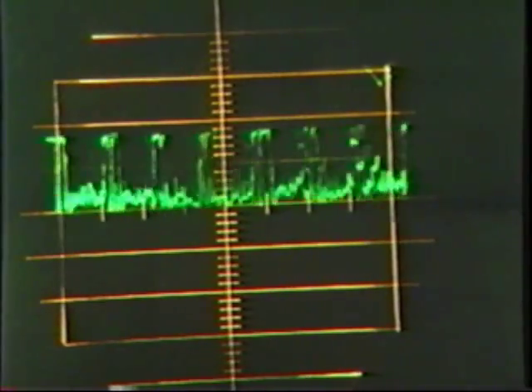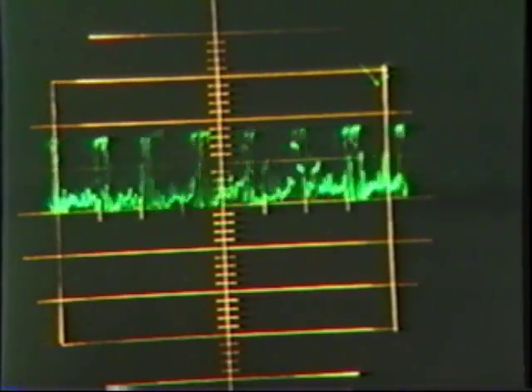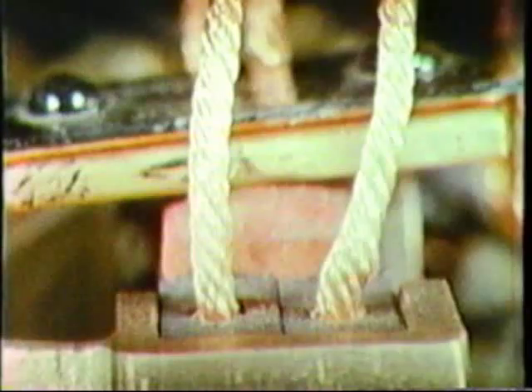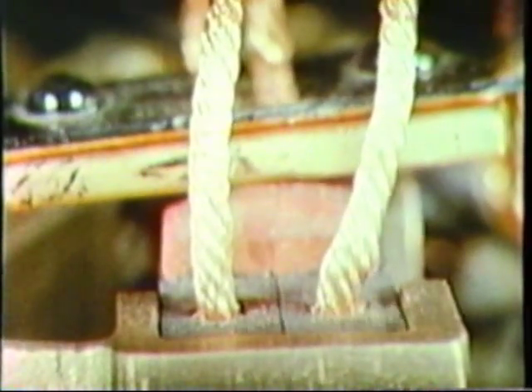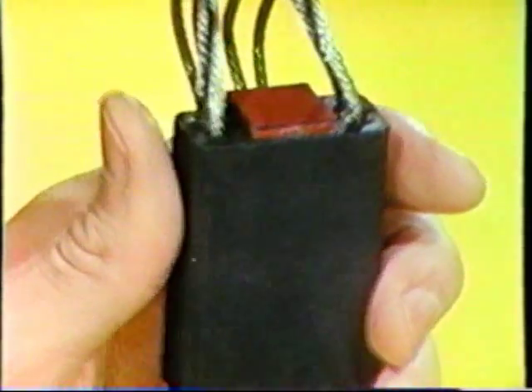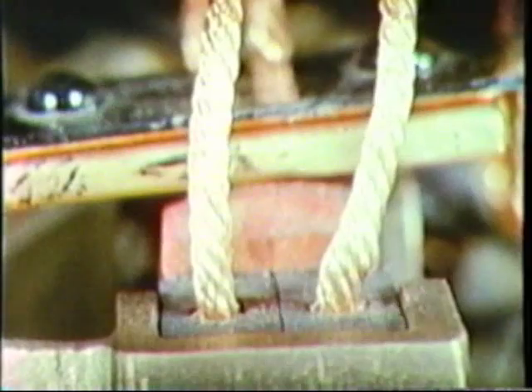This trace is much more uniform, indicating a lower voltage across the brush, which is only slightly disturbed by the flat spots. Clearly the red top reduces electrical wear by improving brush contact. In addition, the red top has the benefits of holding the brush sections together on multiflex brushes for ease of installation. And further, it insulates the spring from carrying current, thereby extending spring life.